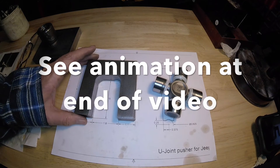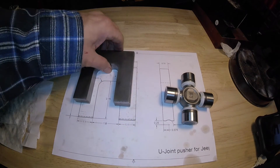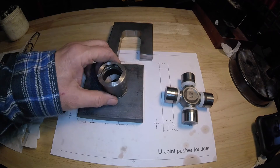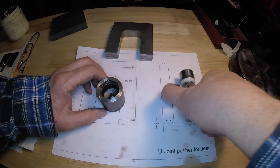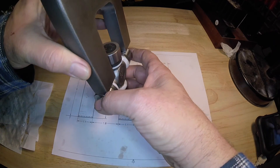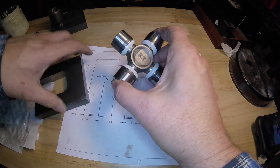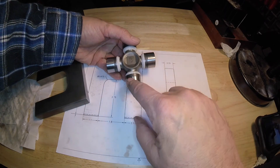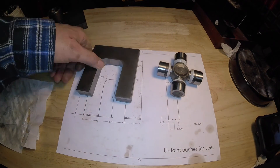I have a little animation to show what happened. Anyway, this will work. If you have an Arbor Press, a really nice way to do universal joints — they sell a kit, it's hundreds of dollars — this is kind of my cheap duplicate. Basically you take a plate with something raised on it with a hole that goes all the way through, which I'm going to make in the next video. You set the universal joint over that in the drive shaft — that's your accepting cup. Then you put this on the trunnions, or in this case on the ears of the drive shaft, and you push, so it pushes the ears out with no chance of bending them because you're putting a direct force. The load path is straight through the trunnion with your backing, so there's no chance of bending those ears.